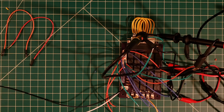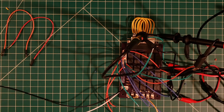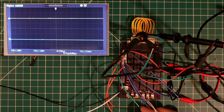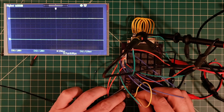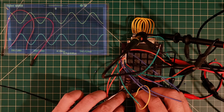For test number three, same as the first part of test two except we have the probes on the sends of insert number two. We have no signal on the oscilloscope. When we activate switch number two, we hope to see the signal being sent to insert send number two. And in fact we do see a signal there, so insert number two send is working properly.